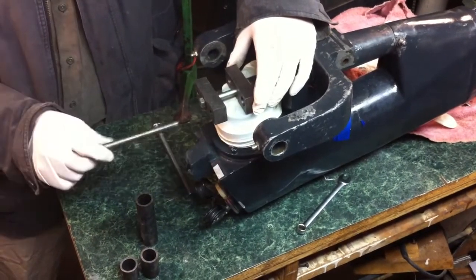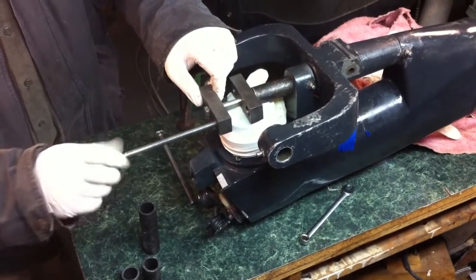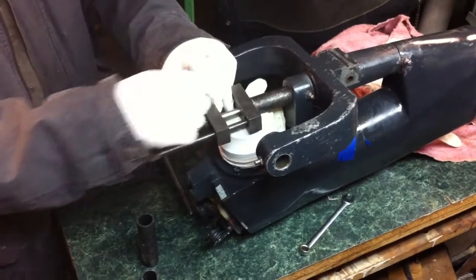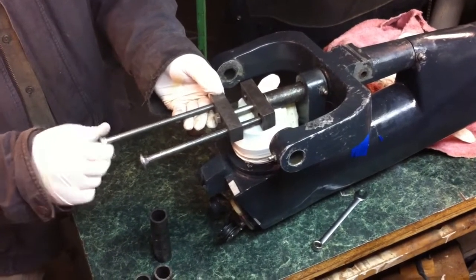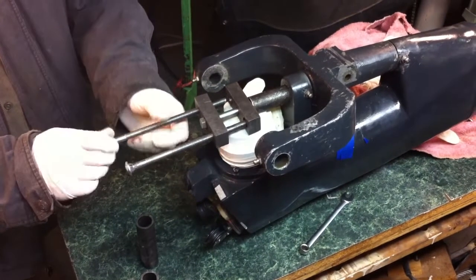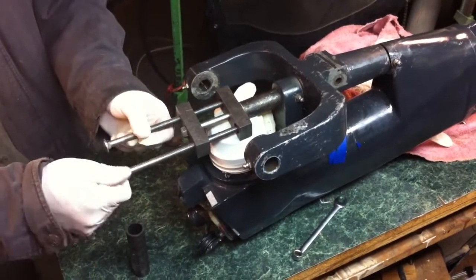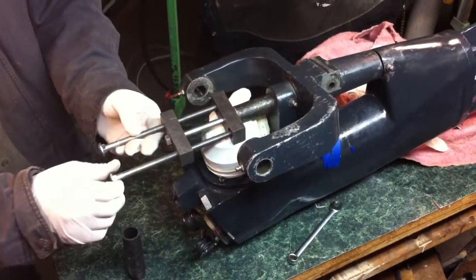This presses against it here and here, and then we take a couple of other bolts, run these through the outer two threaded holes. Once they're in place we will be able to compress the two blocks apart. They'll press apart and as they press apart they'll lift this bolt which will pull that pin right up into the open space. Now I've freed this one up using this method and it worked really good — just pulled that pin right out. So we just turn these into place and as they tighten up they press and pull, extracting the pin. We'll wind it out as far as it'll go and then take the center one off and see what it looks like.